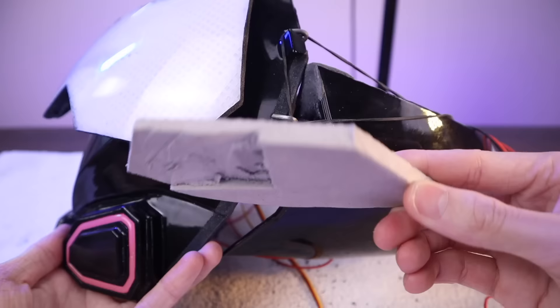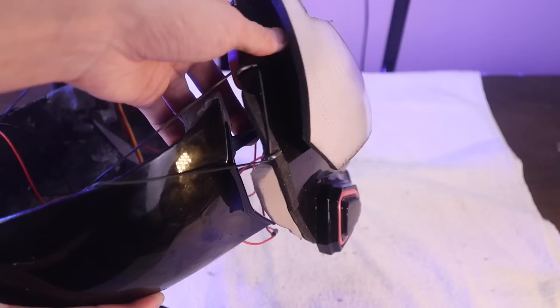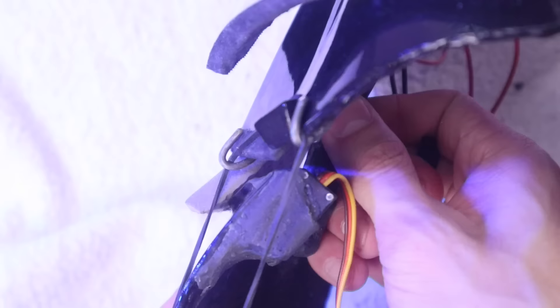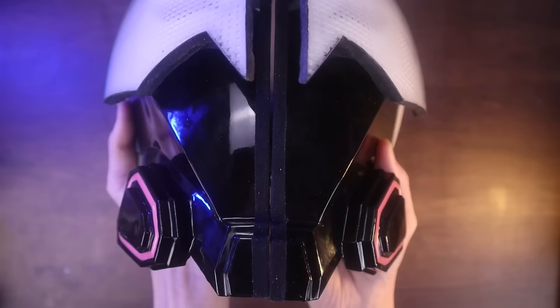After I added those rubber bands, I put some EVA foam in between the faceplate and the backplate so that the faceplate has something soft to slam into when it opens. It would have been better if I used black foam, but I only had grey on hand. I also put some EVA foam on the servo arm right here where it makes contact with that backplate for the exact same reason. And then I used some hockey tape on the faceplate so that when the mask closes, it doesn't damage and hack away at itself.